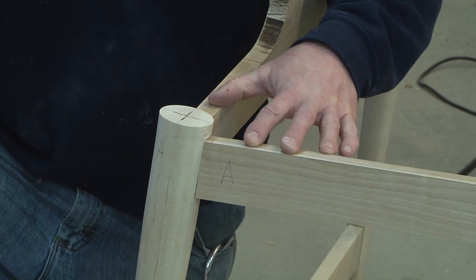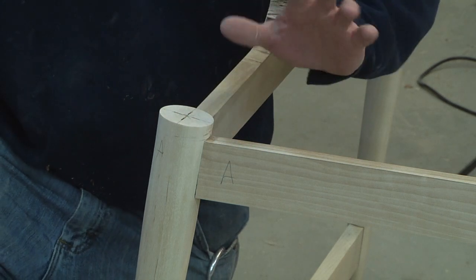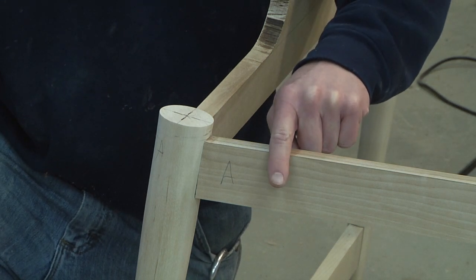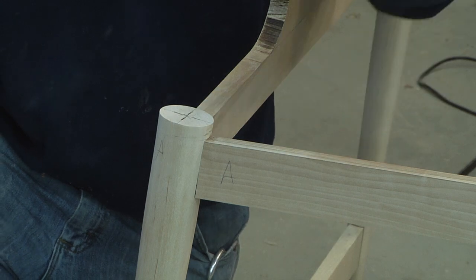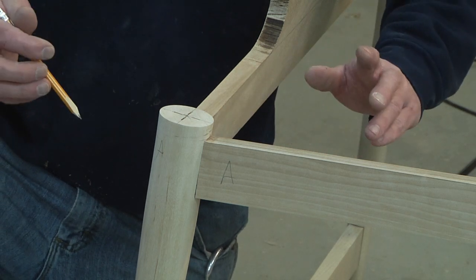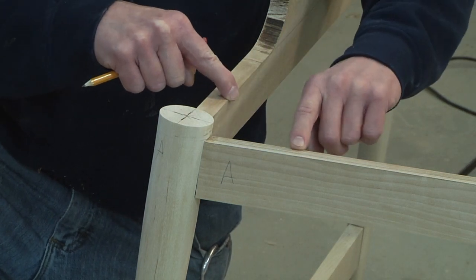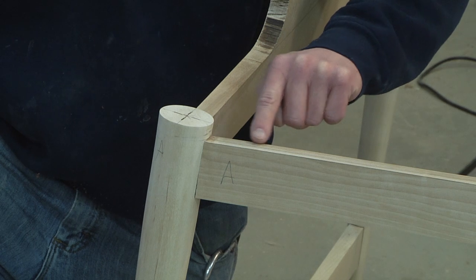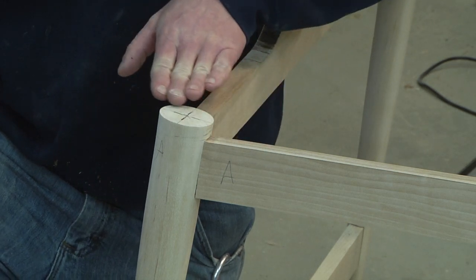All right, so I've been doing a lot of thinking about how to fix this leg top. So the initial plan, what I was thinking was cutting this on a 6-degree bevel. That way then this will be level with the ground or the top, okay? Because this stretcher is angled on 6 degrees. You can see 6 degrees. So essentially right now, the outside edges are level, and of course the inside edges are angled down. So I thought if I planed off the outside edge and make that level with the back, then I could just lay a saw on here, flush, and cut the leg off.